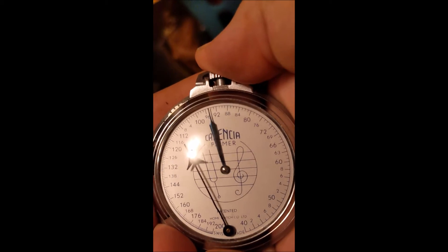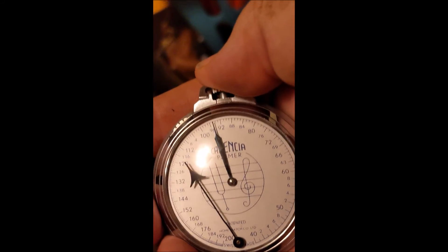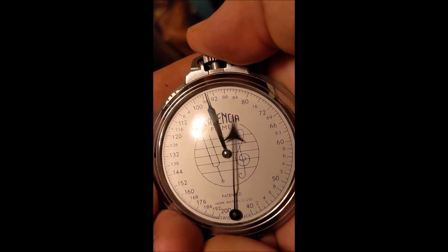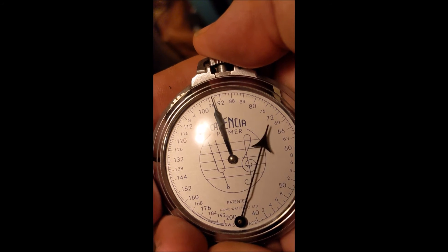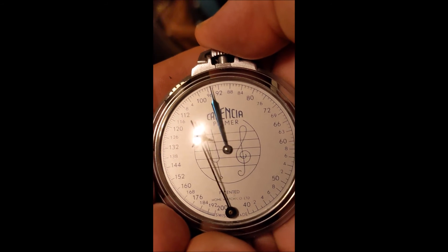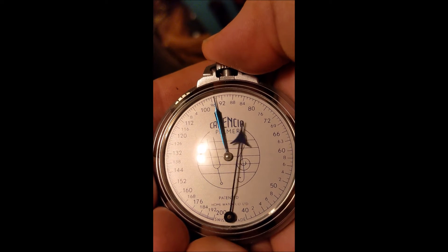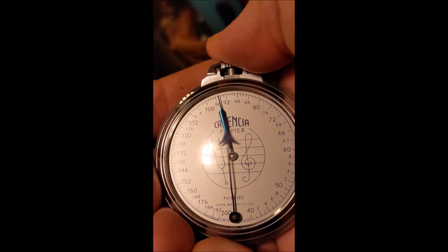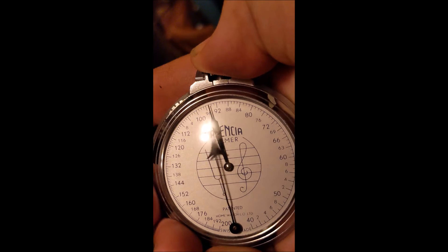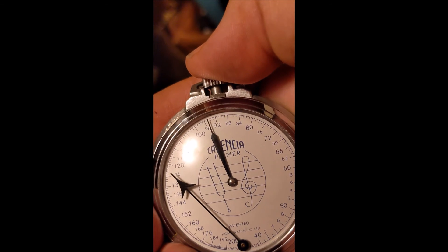It took me a while to figure this out. But when it parks, it's because the hand that goes back and forth is attached directly to that assembly that rocks back and forth — not the lever, but there's a sub-assembly in there. It has a long pivot that goes through and then attaches at the very edge of the movement. So when it's stopping, there's a tail on there, and when those levers come in to stop it, it catches that tail and stops it at the left-hand side and parks it.